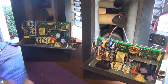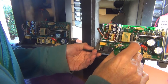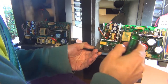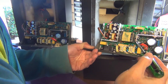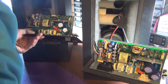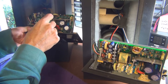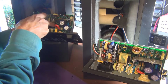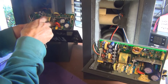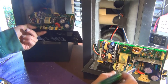Having a look at these side by side, you can see on this right-hand assembly resistor 4 and resistor 3. You can notice the capacitor sort of comes out on an angle to the left, making all the difference. On the left one, the capacitor here is pretty straight, and that resistor was a little bit closer to this capacitor. What I'm going to do is remove this capacitor and put a new one on.